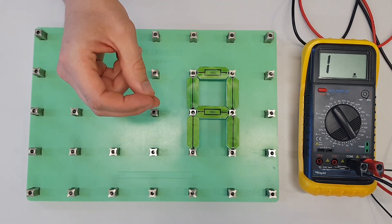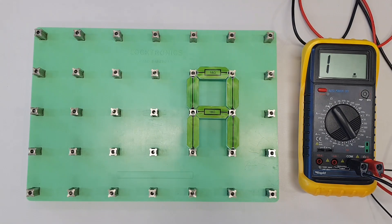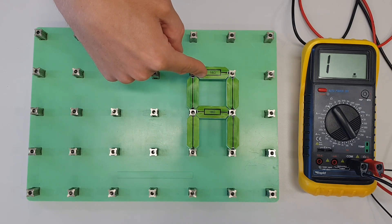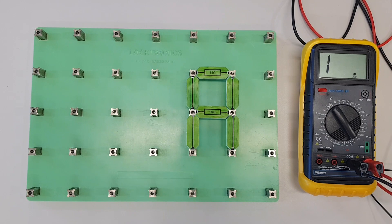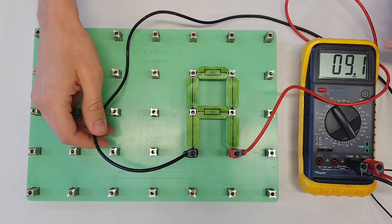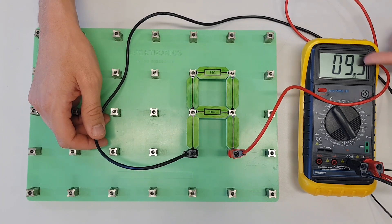What we're trying to do is figure out what is the total resistance of a parallel circuit. We've got two 18 ohm resistors connected in parallel with each other, so what's the total resistance going to be? This can be a little bit confusing at first because we've taken an 18 ohm resistor, added another 18 ohm resistor, and we might think we'd have something more than 18 ohms. But if we measure the total resistance of this circuit, we can see that it is actually 9 ohms. That should be exactly 9 — we've got resistor tolerances — but we've got 9 ohms there.